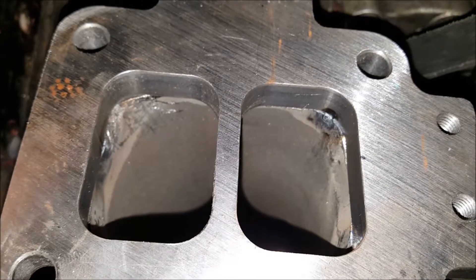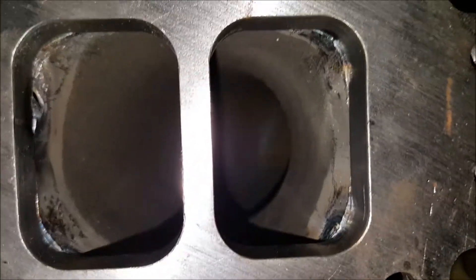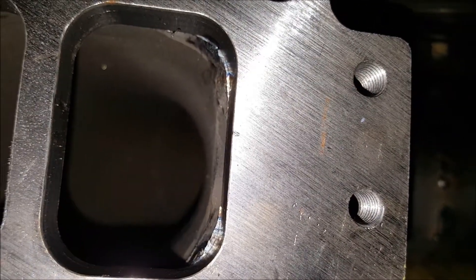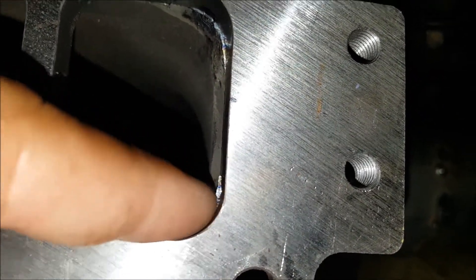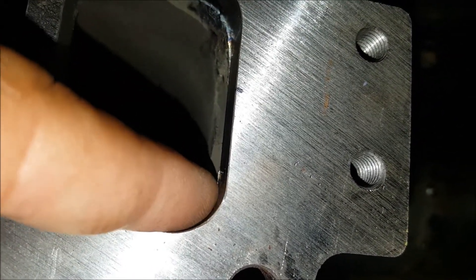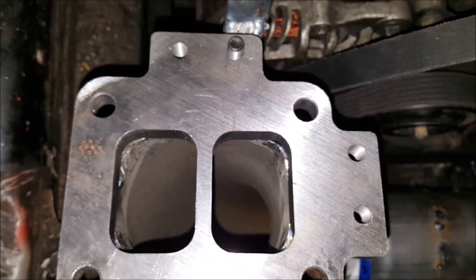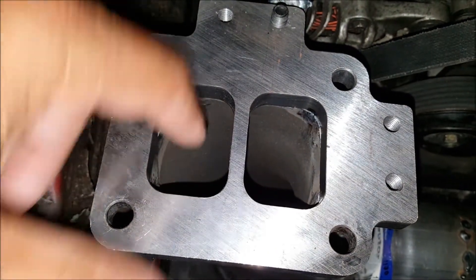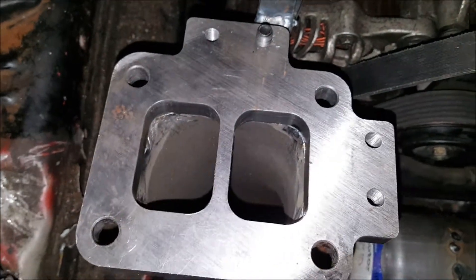That's one of my dilemmas when doing some welding. At least if I build up the outside first and then come through the inside, I should be fine. Some of that material will blow — like, once I start heating it up I can tap that out, even though it's literally like 1/32nd of an inch. It's all about the transition to flow. You can square it off with a hammer and chisel and use a vice like an anvil to get your edges.